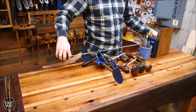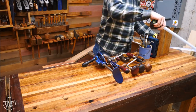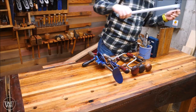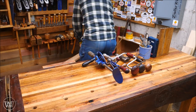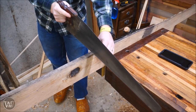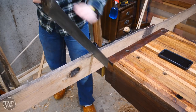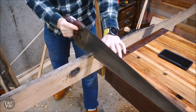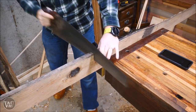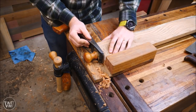I'm going to start just about the same place I've started with all of these other tool storage projects. I'll lay things out on my bench and try and figure out how they would best fit, where they would best be, sort them around and try and figure out how much space this is actually going to take. A lot of this has been in my brain for a while, but I settled on this idea after putting everything in place. First thing I need to do is cut up a piece of white oak — this will end up being the shelf. It's about 38 inches long, and there's a big knot in the middle of it, which isn't a problem at all.